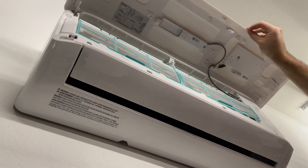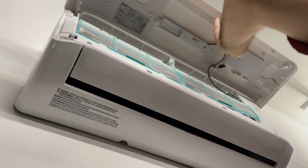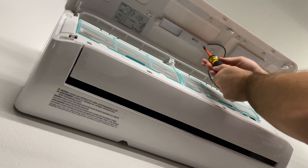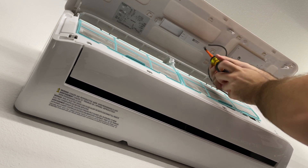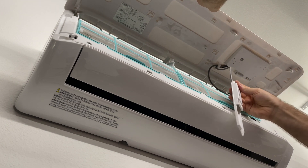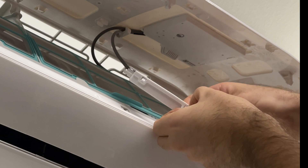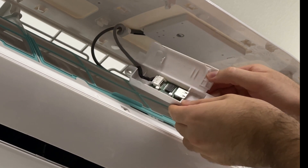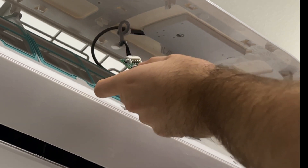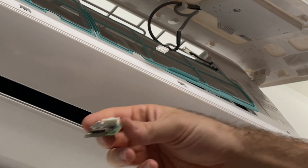You're going to pop the front lid open and locate this plastic unit. You can look through and see there's a USB port. Take a screwdriver to remove this screw, then pull it out at an angle — be sure not to lose the screw. Locate the two clips and just pop them open. It will reveal the USB module, and you can just pull it out — it's not screwed down or anything. Then carefully remove this white plug, and now you're ready to go make those cuts.